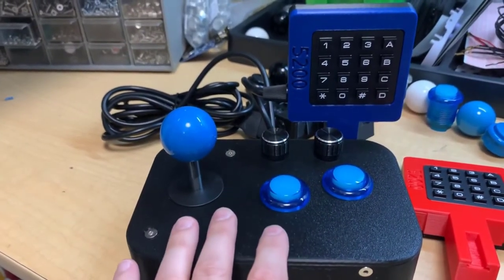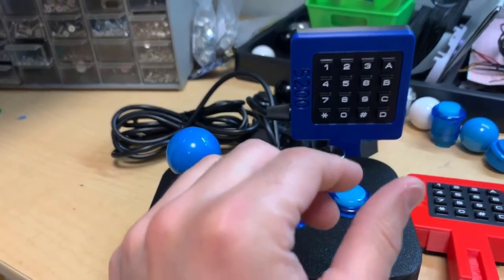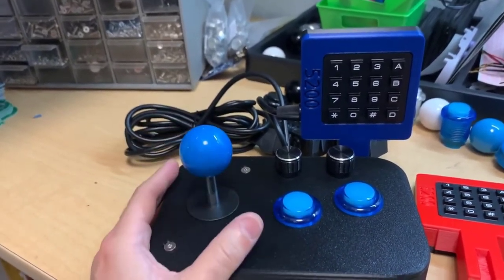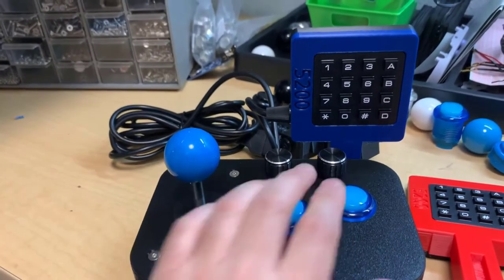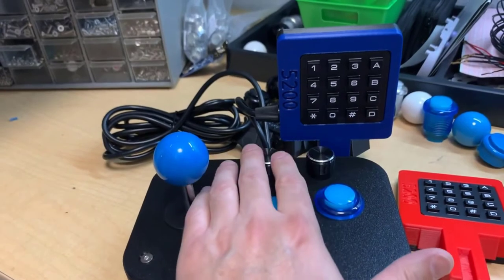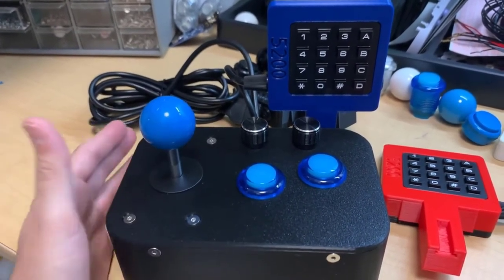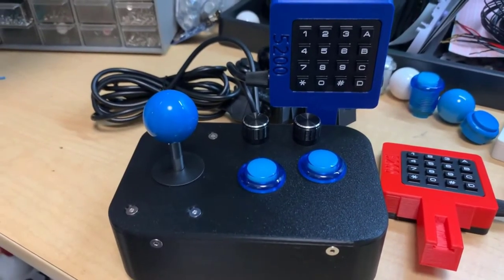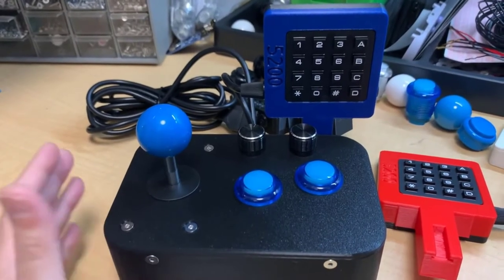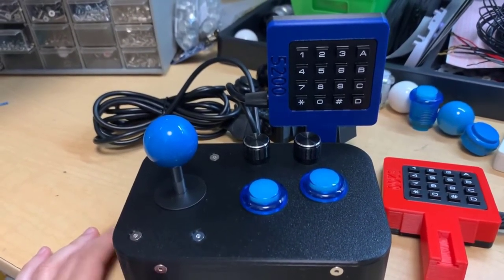With the original Atari 5200 joystick it was analog, using variable resistors for horizontal and vertical movements. This arcade stick uses microswitches to control movement, and the trim knobs handle auto-centering for the Atari 5200's technology. A nice side effect is you can use the knobs for paddle games. Most games work great with the Atari 5200 arcade stick except those requiring true analog control — for example, Missile Command will just move the cursor very quickly. I've sold a number of these, there have been several reviews, and people have been very happy with them.